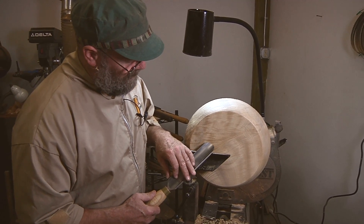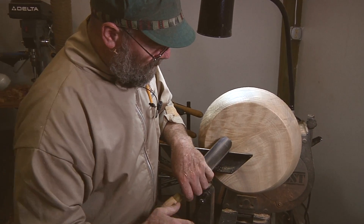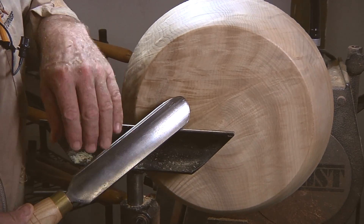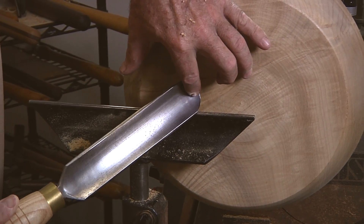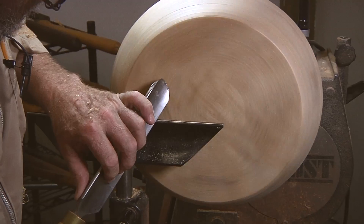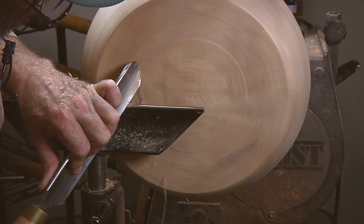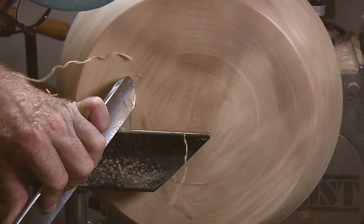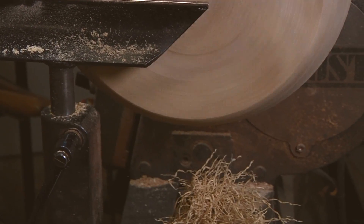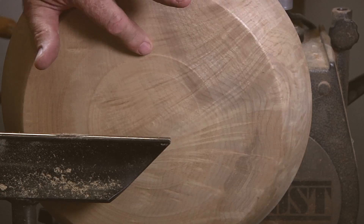This is another big variation of that continental spindle roughing gouge. This one has a much more rounded nose profile on it. I want it up on its edge, and since the nose is so round, I don't want to be working up here because that makes the tool unbalanced — I want to be working more down here, so drop the handle way down and then roll it over until it starts cutting. If you look at the shavings, these nice little curlies are coming off nice and easy, very little resistance, and a very clean cut. That's that high shear angle.